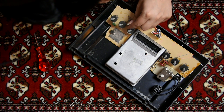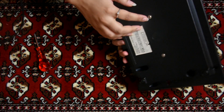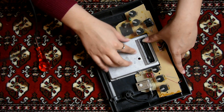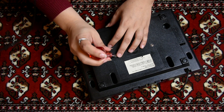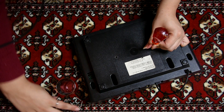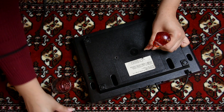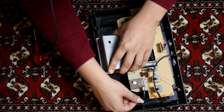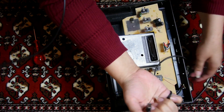It's 1000 microfarad, 25 volts. Best thing to do is just get this out and get a 2000 microfarad 25 volt in here. We have two more screws here. Let's take out this very nice shielding - it's like RF shielding and it's solid metal, not tin foil. I wonder what made the heavy sixer heavy inside.